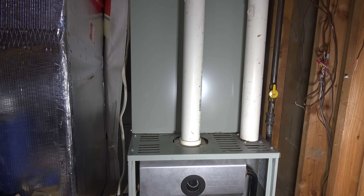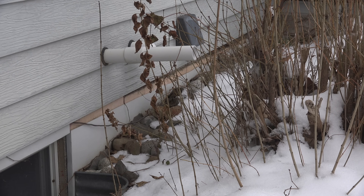Here we have the outside piping. This one's a little unusual because one pipe just goes straight out — there could be leaves or something in it. There's another pipe just on the other side, a little hard to see from here, but it's pointing down. Check both of those; check for plugged screens or anything that might be in there. Those are the simple things you can do to see if you have a pressure problem on this system — not caused by the pressure switch, but actually caused by venting or condensate drains.